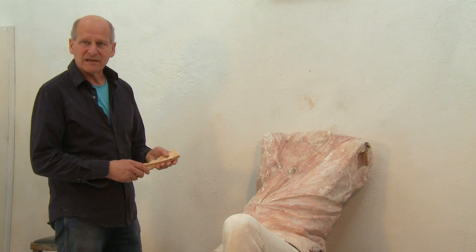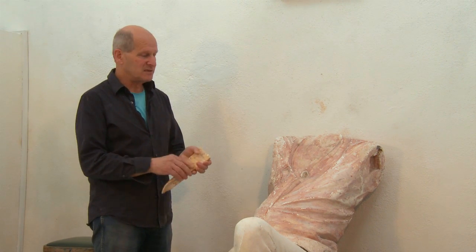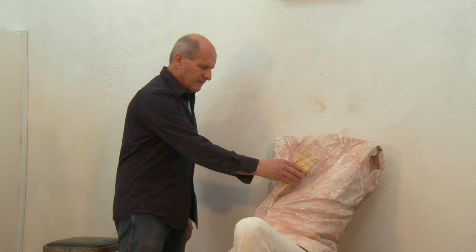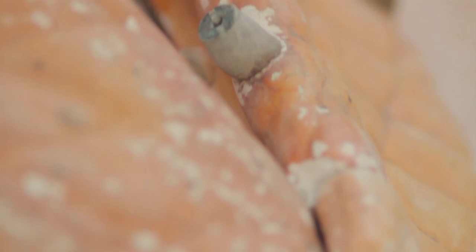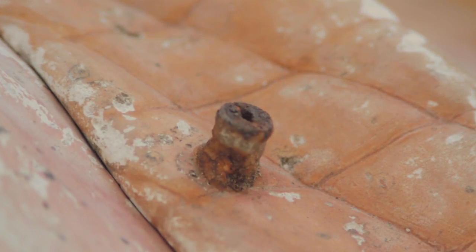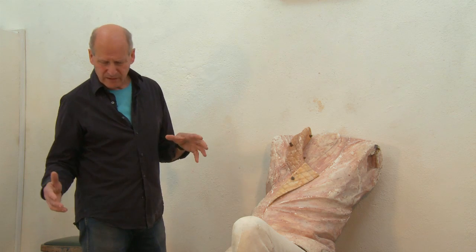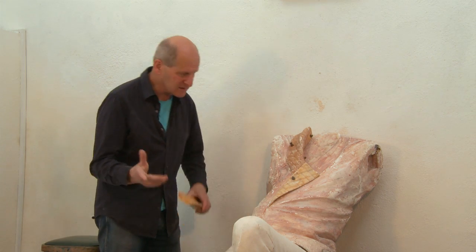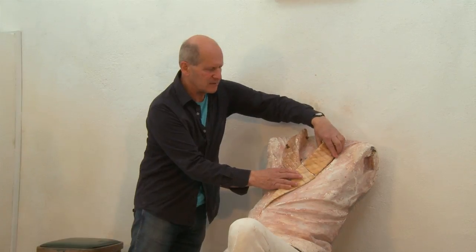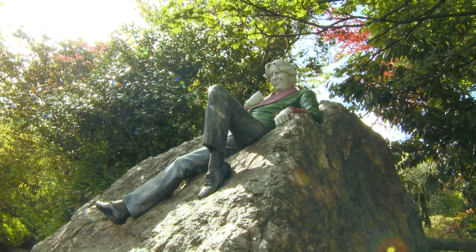To do this, I had to revive several completely obsolete 19th century techniques of making and measuring the pieces of stone in a very accurate way, and also fixing them together so that they would allow for expansion and contraction without cracking when they're at different temperatures, like if you get a hot day and then it freezes at night or something like that.